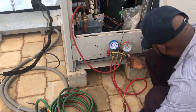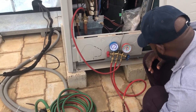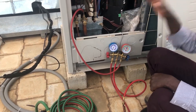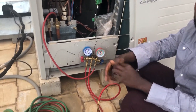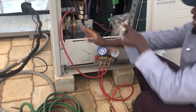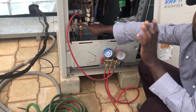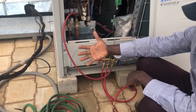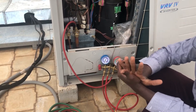So nitrogen is just for pressure testing and flushing. After brazing all these pipes, there is a lot of dirt — dust, stones — that can enter inside. So before I connect here, I have to flush by putting nitrogen in from one end so it comes out the other side and removes all the dirt inside. It has a lot of pressure — it can even injure your hand when you're holding it like that.